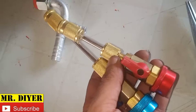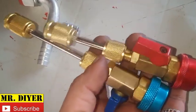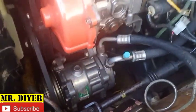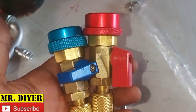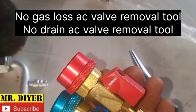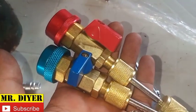Don't worry, these are cheap. I bought this six or seven years ago for about a thousand pesos — roughly about eighteen dollars. You can buy this by piece, but preferably you'd want to buy it by pair so that whichever valve is leaking, the high side or low side, you can fix it — because the size is different, the low side is smaller than the high side. Inside there are rubber O-rings to prevent leaking. If you type 'no gas loss AC valve removal tool' or 'no drain AC valve removal tool' in your favorite online shopping platform, something will come up.